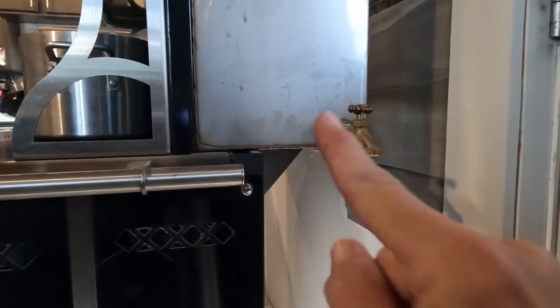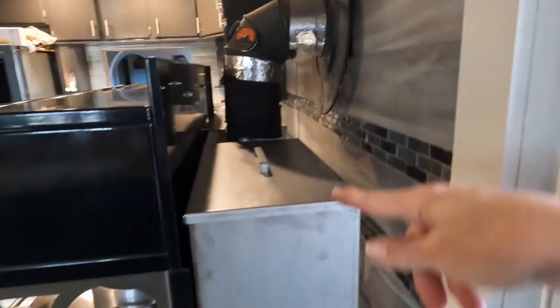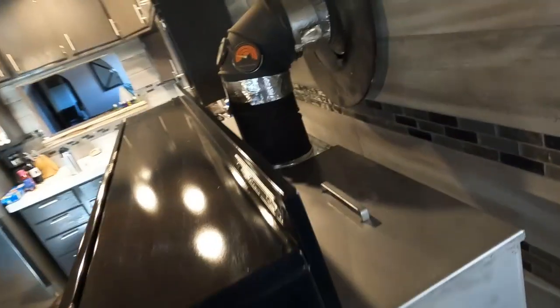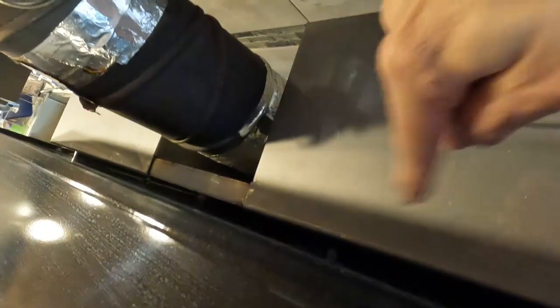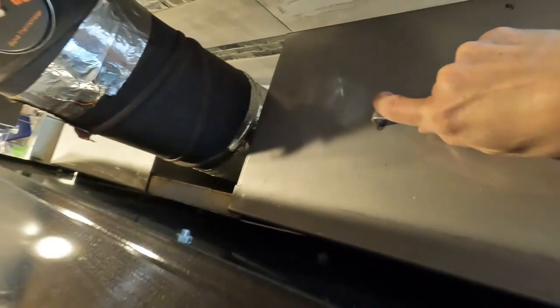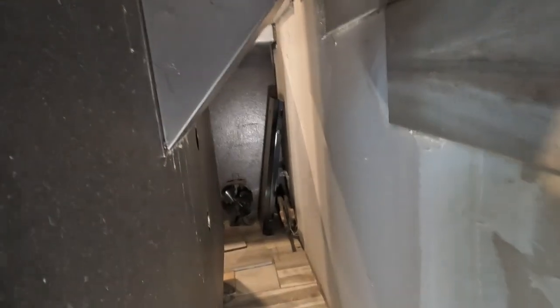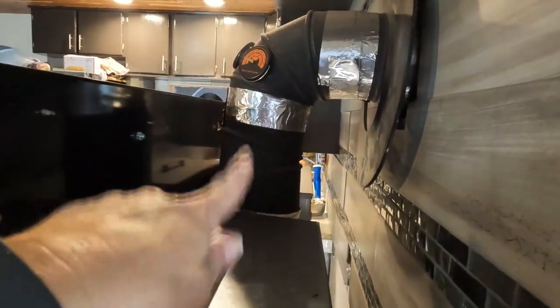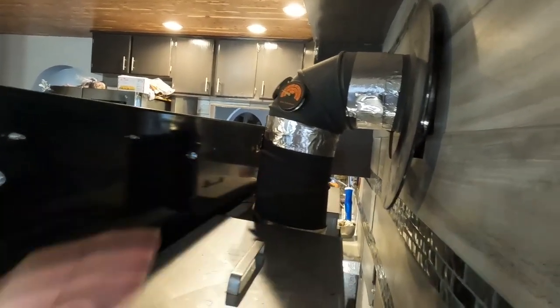So this stove has this tank on it, which allows me to get hot water from this spigot. So there is a double tank, has 24 gallons of water in it. There's a reservoir here and a reservoir there, but they connect in the middle. So it just sits on the back of the stove on this, like, I don't know what you call that. That's hot. And it just wraps around the stove pipe that comes out of the stove and into the wall. So this tank is a horseshoe around that stove pipe.